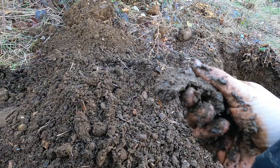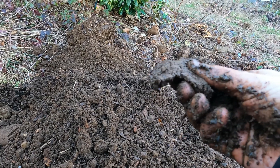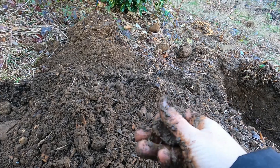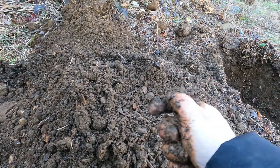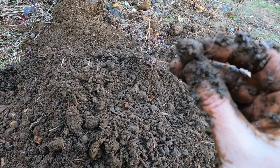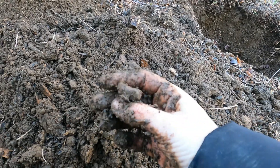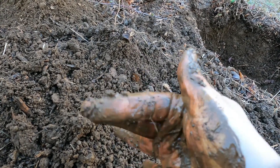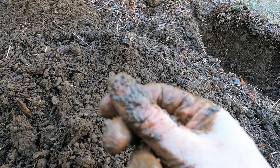It's really hard because it has rocks in it — you can see all the little rocks. It is forming a ribbon, but it's not holding. When I try to form a ribbon and it keeps breaking before it's very substantial, that's telling me it's ribbon-forming but breaking in less than two and a half centimeters. Part of the reason it's breaking is the rocks, but if I were to magically remove all the little rocks, it would pretty much do the same thing — and this is also where the sand is coming from. When I'm feeling for the texture, I can feel the sand, I can feel the grit. And it's also smooth — I can feel that slimy, silty nature of it.